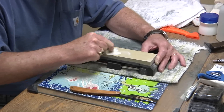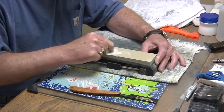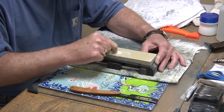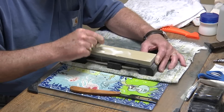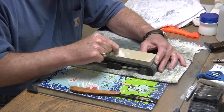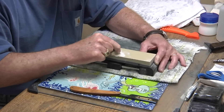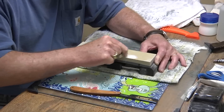After this stone, you can still do 4 or 5 strokes on the chromium oxide if you'd like, but for the most part you should be good to go. As you can tell I'm getting a pretty heavy slurry here — it's not quite a mud consistency but almost. It's fairly heavy and this will be the initial slurry I'm going to work with to start the heavy circles.